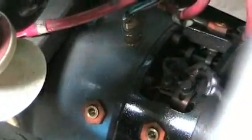Taking all the motor brushes out at once was, as it turned out, not a good idea. If I do this again, I will do them one by one so that the backing plate doesn't get removed.